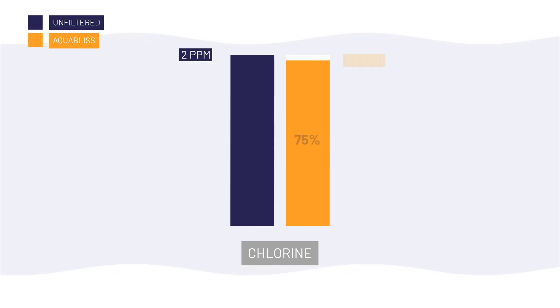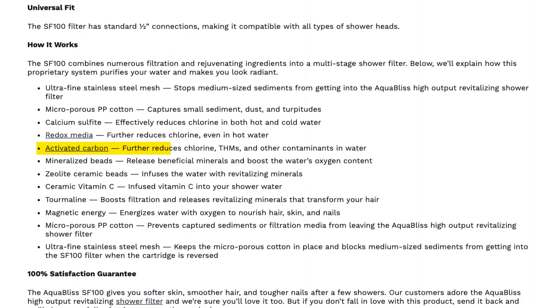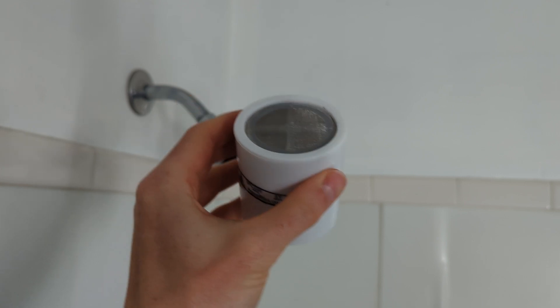Given these risks in shower water specifically, we expected the AquaBliss to focus on effectively reducing chlorine and DBPs. The SF100 only reduced chlorine by 75%, down to 0.5 ppm, making it the first shower filter we tested that didn't eliminate chlorine entirely. There was only an incidental reduction in trihalomethanes, despite AquaBliss's claims that its filter could further reduce these contaminants. The filter also didn't reduce hardness minerals, though AquaBliss does not claim that it can. Their claim of a 12-stage filtration might be more of a gimmick than an actual benefit — it's possible that cramming so many media types into one small cartridge reduced the effectiveness of the more capable media like calcium sulfite, activated carbon, and KDF. A simpler design with fewer high-quality proven filtration media might have yielded better results.